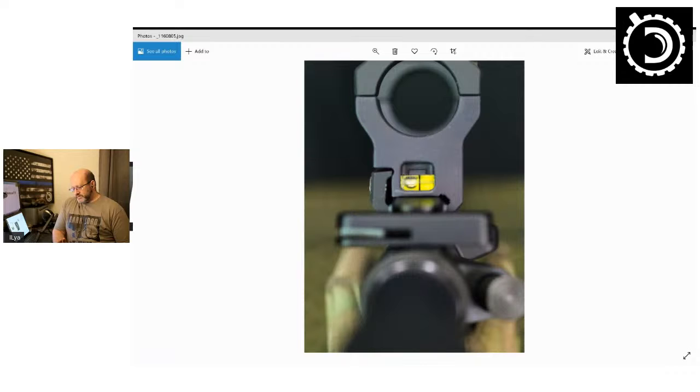Okay, so this portion is sort of important. Why else is it important? Another reason why it is important is torque. If you are just squeezing this rail from the sides, you really have to be super careful with torque. If you are using a NATO spec mount, when it's basically being pulled on top of the large flat portion of the rail, it's much more forgiving of torque settings, right? If you are looking for the most repeatability, you still need a torque wrench and all that. However, if you just want to mount it reliably, you don't need to worry about all that much. Now, don't go farmer tight on it, but you have a lot of leeway, and it will still work perfectly fine, right? Okay, that's Picatinny versus Stanag.